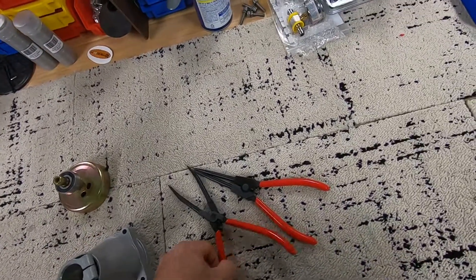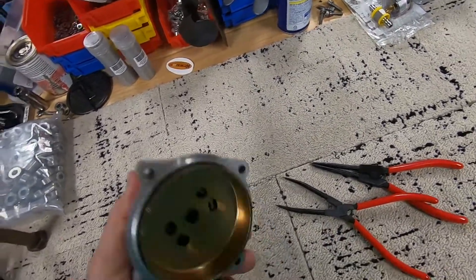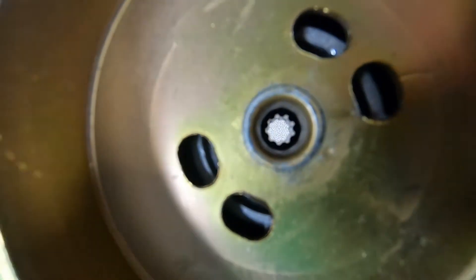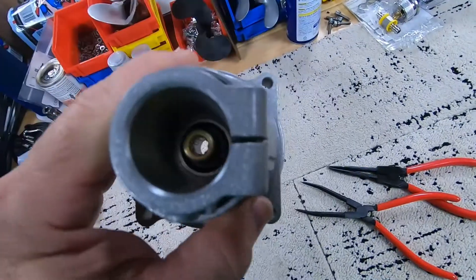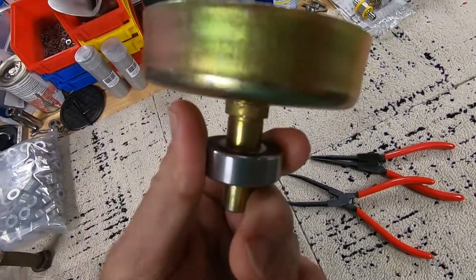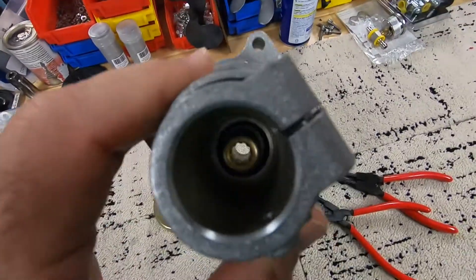Just got to make sure you have the right tools. It took three iterations of long-nose, long-reach internal and external circlip removers to get this to work, and it does now. There's your bearing — the grease should be done internally on that. Same thing back here: there's a clip that needs to come out, this gets knocked out, and that gets replaced. It's that simple.